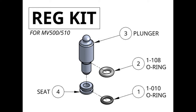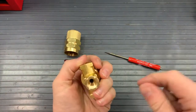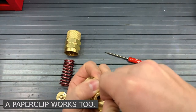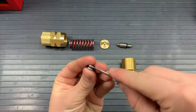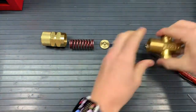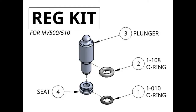With the plunger, there should be that 108 O-ring, and you can take that off if you want — you're replacing both of those, so it doesn't really matter. Inside there is a seat, and this is where you want a small screwdriver. If you come from the bottom of the regulator, you can reach through the bottom there with a small screwdriver and just kind of poke it out little by little. You are replacing it, so damaging that seat won't be a problem. If you don't have access to that bottom port, you might need something with a hook or another tool to get that out of there.